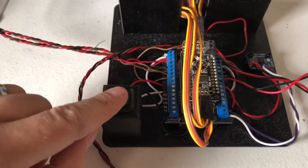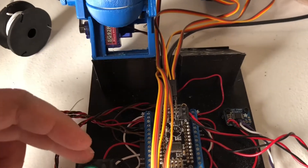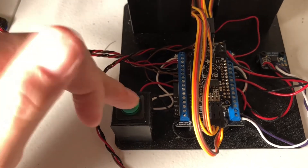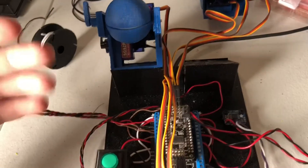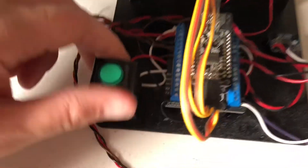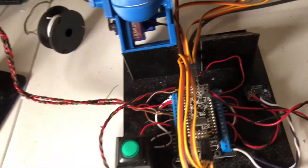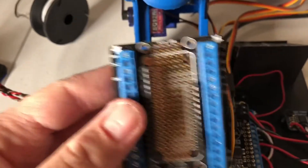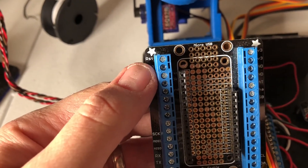Here's our button. The white wires are for the switch. The button is supposed to reset the board after you hit it, to restart the program for the next user to program the eyeballs — so we want to hook to the reset pin. I have a duplicate board here. This is the same Feather screw shield — the top pin is RST, which is reset.